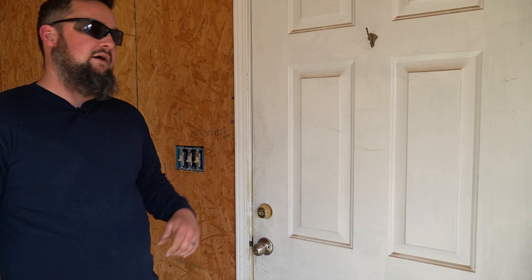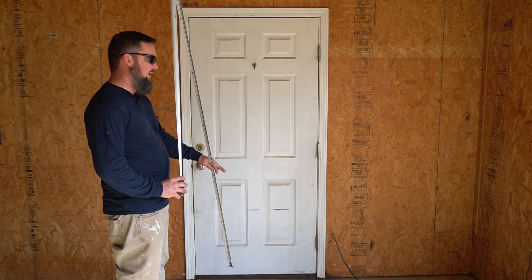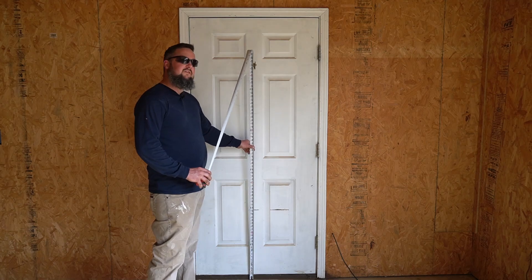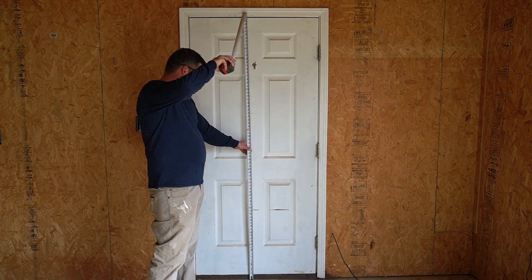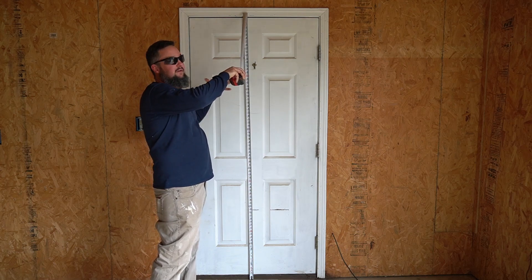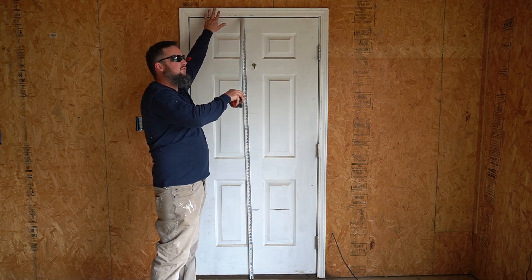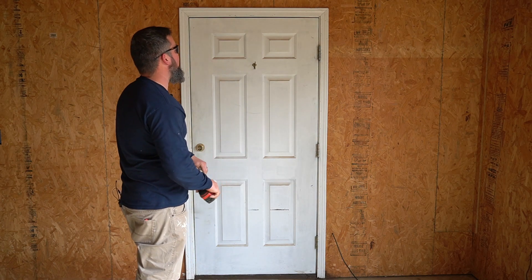The height is a little trickier because you have to contend with whatever flooring you have, and a lot of older doors have weird thresholds. In this case it's a shop, so it's simple. 82 inches is the height you're looking for with standard in-stock doors. From the concrete to that little groove in the trim is 82. Inside a house you're almost never going to land right there — the door may look shorter. You may have to pop that top trim off just to be sure you've got about 81 and three-quarter inches of space. If you don't have 81 and three-quarter inches, you're going to struggle.